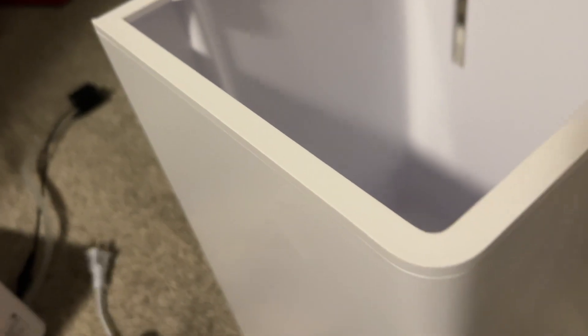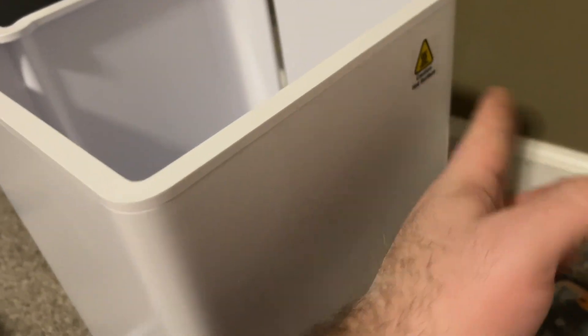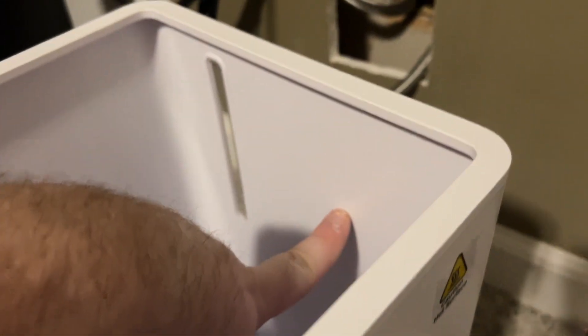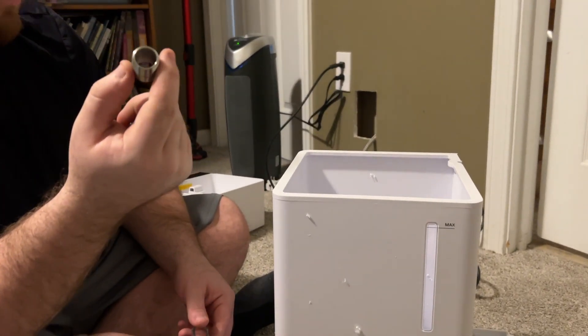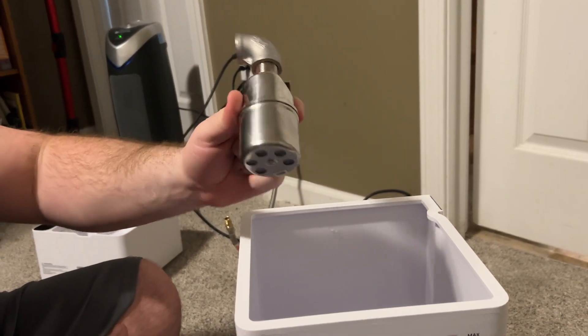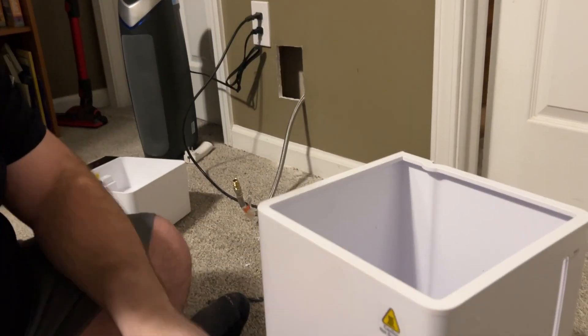So that comes to the tank of our humidifier. This is one I'm going to recommend to anyone watching because of the shape — a lot of them are rounded and that would make it really hard to seal things. This goes on top because on top is the motor part; it has a little pump that pulls up water from the tank. I'm going to come in from the inside and have the elbow with the float valve in it. This is our half-inch fitting that's going to hook into our elbow because it has to sit straight down in there — it can't be sideways or angled.